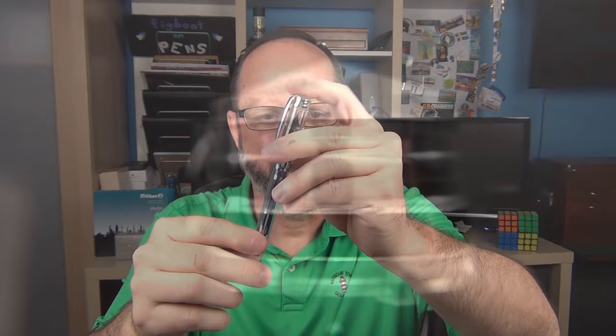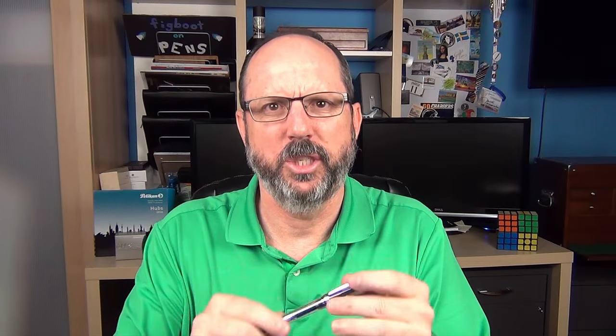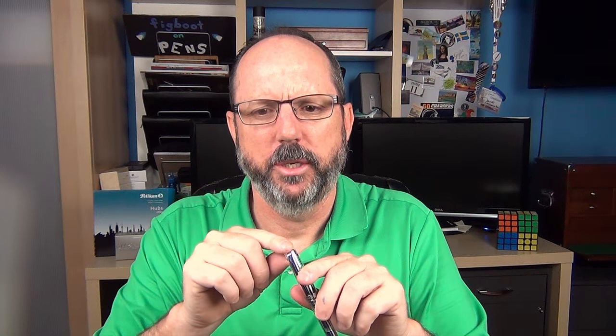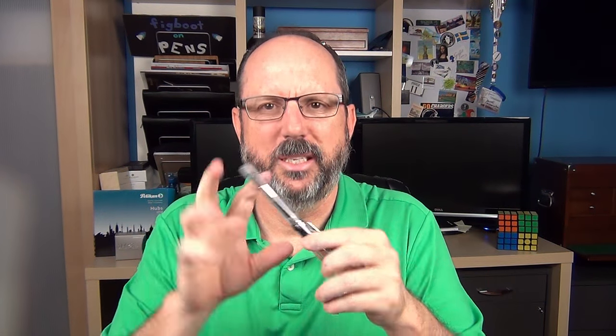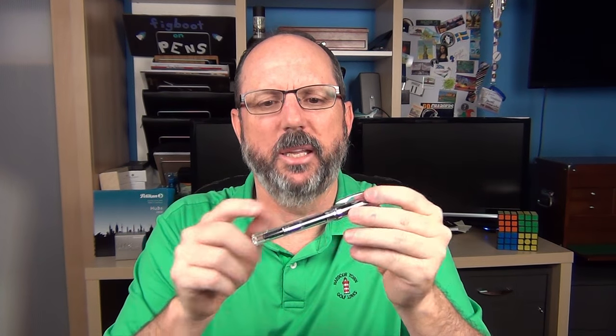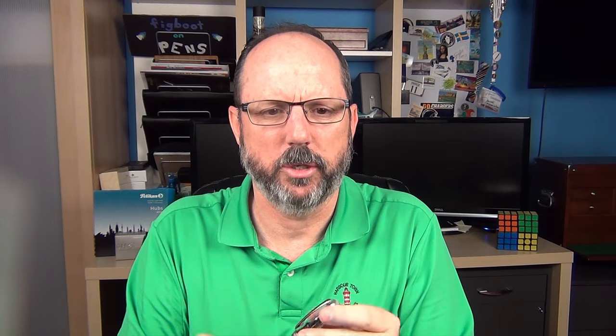Starting at the finial, there's one feature I like and one I don't care for. I like the somewhat pointed finial — it looks nice in profile — but when you look straight down, you can see the gate blush on the inside of the cap. On injection-molded plastics, the gate blush is the point where plastic is pushed into the mold, then sanded down, leaving that mark. It's on every piece of injection-molded plastic; some manufacturers just hide it better. I think having it right there on the end takes away a little from the looks of the pen.